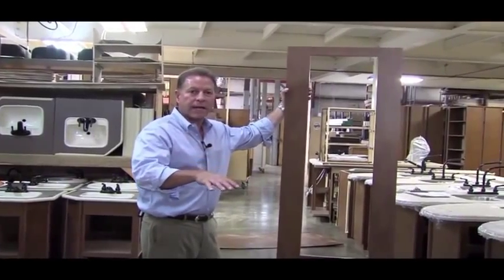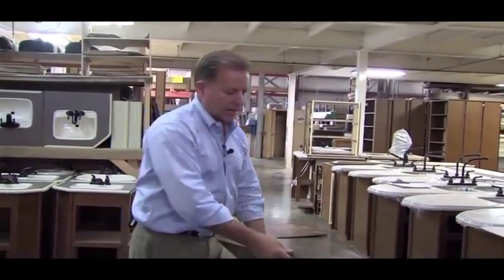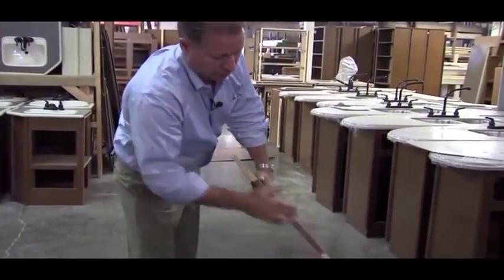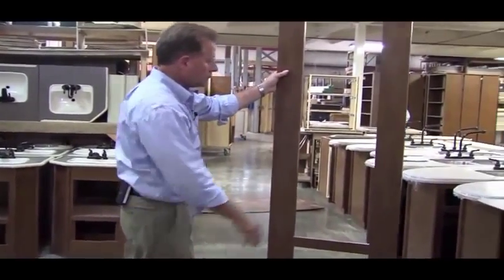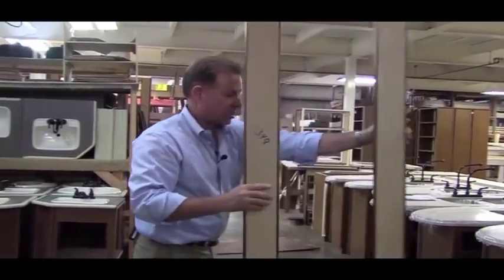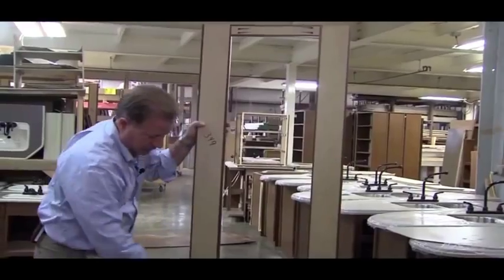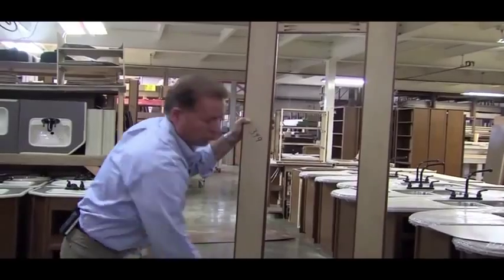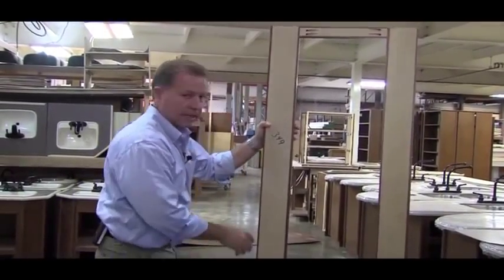Okay, once we get the flooring down, then we're going to start setting our interior cabinets in the coach. And we start out with a wood core product, which you can see is a real wood product and not a press board or particle board. This is a face frame of the front of a linen cabinet, but if you'll notice on the back side, all of our joints are screwed together, not stapled together like some of our competitors do, so that cabinet is going to hold up and not wiggle loose from just having a staple pulling it together.